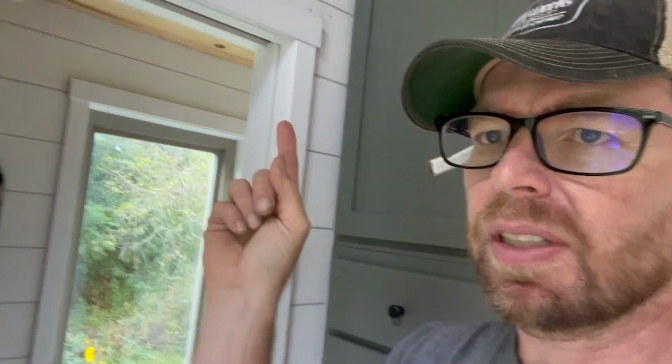Okay, last piece here. Last two pieces, actually the last three pieces. It's tough to get these in. I'm trying to get this really tight because I don't want to put a piece of trim around. I might, if there's any little imperfections around the ceiling. Generally what you should do is put the ceiling on first and shiplap up to it if you don't want to have a trim piece, because then you don't see up there.